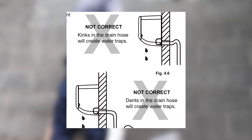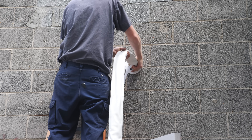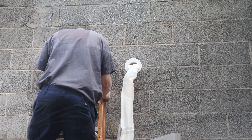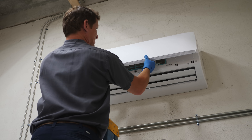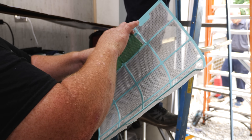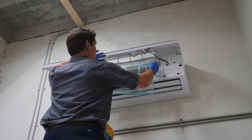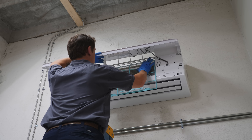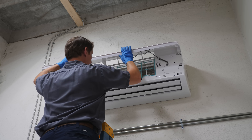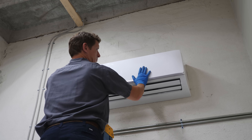It's really important that the condensate line isn't kinked or crushed in any way, as the water needs to be able to flow freely. There isn't a pump, so the water purely relies on gravity to flow out of the pipe, which is why the pipe runs straight down the wall. This unit also had smaller secondary filters that could be added to the main filters to help trap more fine dust. If you're installing your unit in a shop environment, you really need to make sure to clean your filters regularly — at least about once a month. Otherwise, the condensate line will get filled with dust and back up, leading to a bunch of water dripping into your shop.